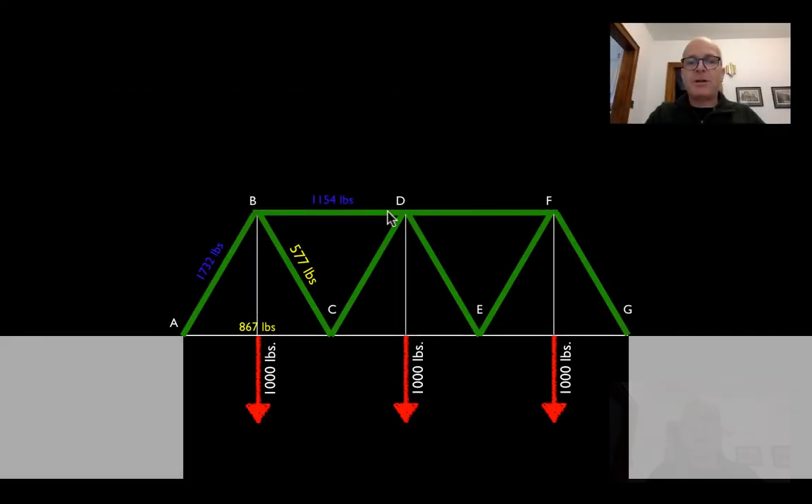We can go back and put that onto our truss. To keep track, we'll change the color of the text: blue always represents compression and yellow always represents tension. As for the node where the hanger connects with the bottom piece — that's fairly trivial. There's only a vertical and a horizontal member, so the vertical member carries the entire 1,000-pound load, and the stress on each side of the hanger in the horizontal member must be equal.